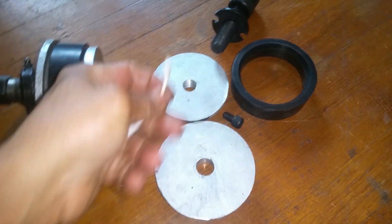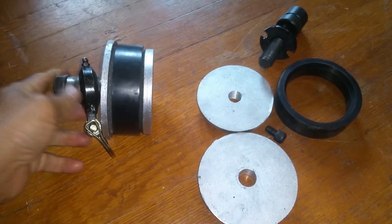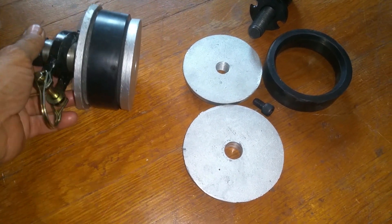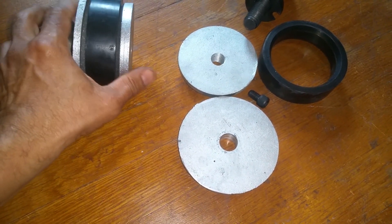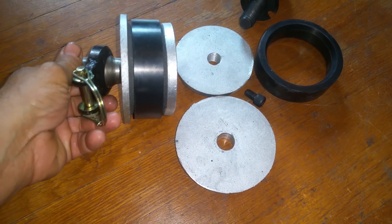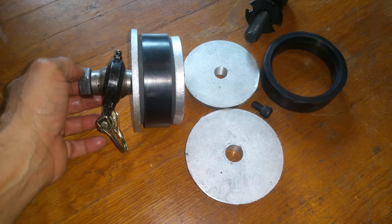You are putting this down with a low slump concrete, not a high slump. Who wants high slump concrete anyway? Unless, of course, you have a water reducer in there, which gives you the high slump — which is awesome. Super plasticizers.